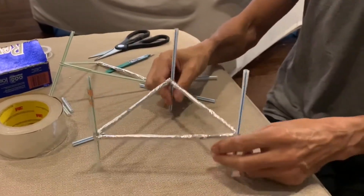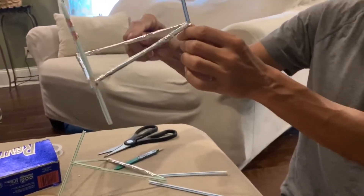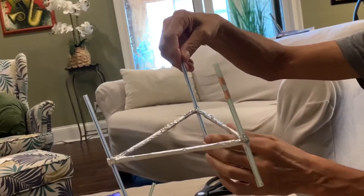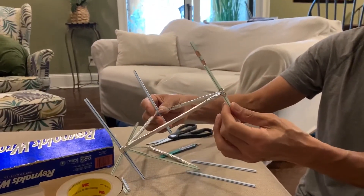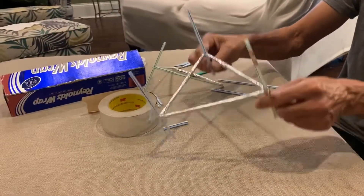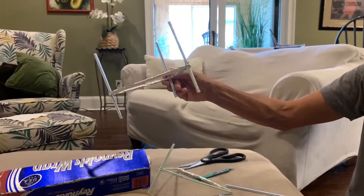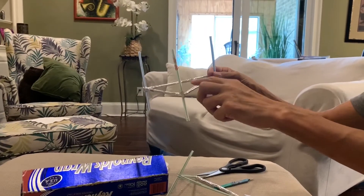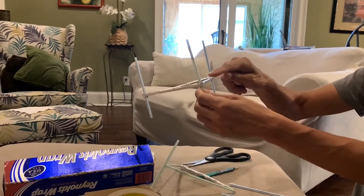Here's one that is completed and ready to run. The legs allow it to stand, and this foil part is going to be the negative. I've put a very thin wire — about two inches — wrapped around all three of the top corners, which is going to be the positive part. This design has not been tested for flying; most lifters you see have foil wrapped over to form a foil skirt. The key to getting these to work is keeping them light, and the wire needs to be at a reasonable height — if it's too close to the foil it will arc when you apply high voltage DC. I'm using about two inches of spacing.